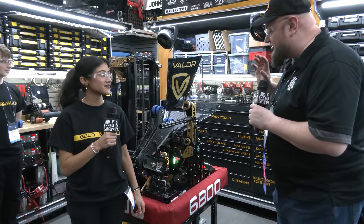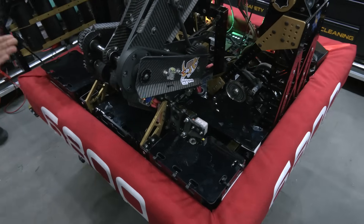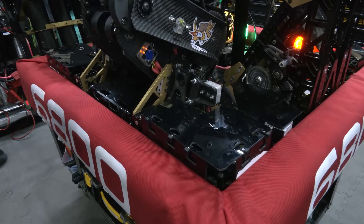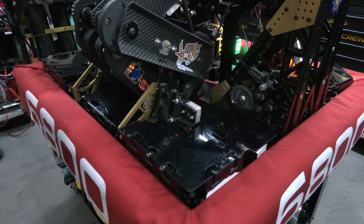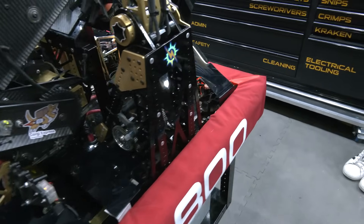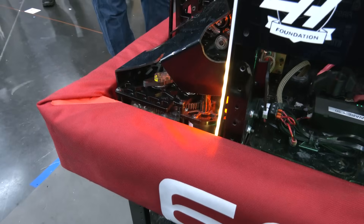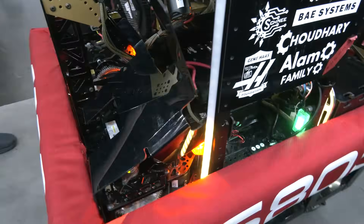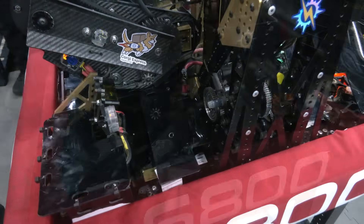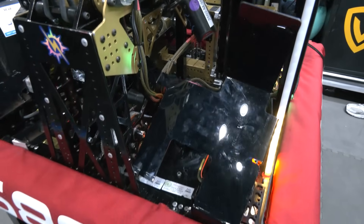Let's start talking about your robot with your chassis. So going into the season, we knew we wanted a very large chassis because from previous experience, we learned that a small chassis would be too tippy. So we went for a low center of gravity. Our 28 by 28 inch chassis features a Swerve X2T system with four swerve motors and four azimuth motors. We have four 2x2 chassis rails with a half-inch hole pattern, allowing us to easily mount all of our subsystems and have ample internal space. All of our electrical stuff is mounted underneath to ensure low center of gravity, all wires wrapped in cable wrap, and the battery is mounted underneath as well.